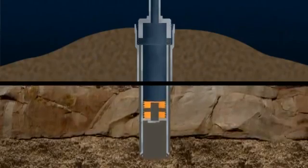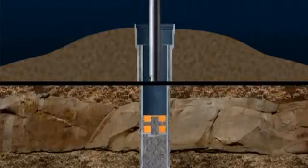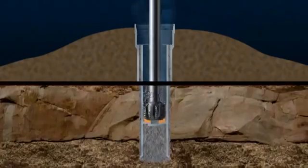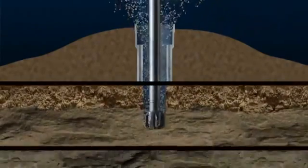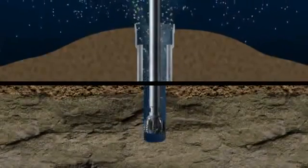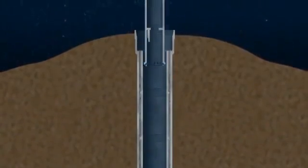The cement plug tool is removed, and when the cement has set, drilling continues with a smaller diameter bit, penetrating the cement plugs and float collar and into fresh rock. After a suitable depth has been drilled, the drill string is removed. Then steel tubing, known as casing, is lowered into the hole and cemented in place.